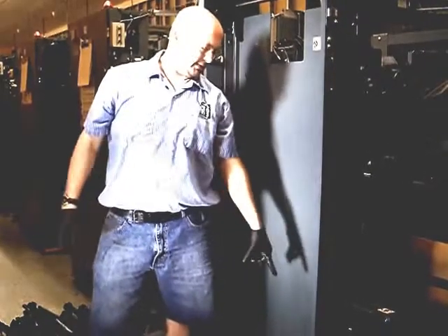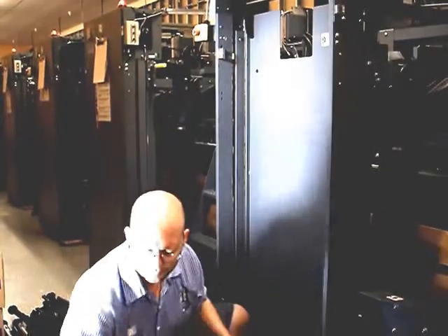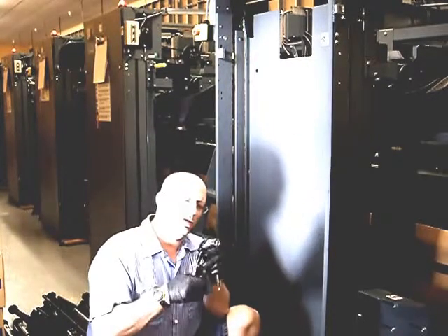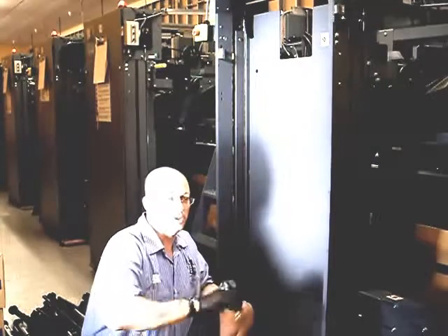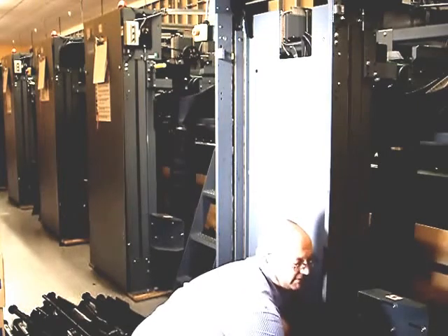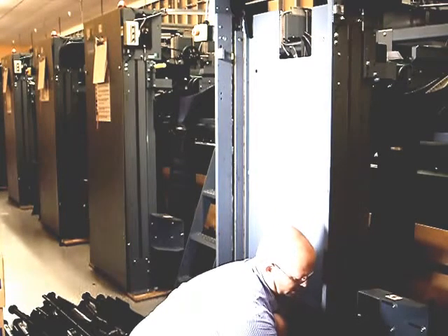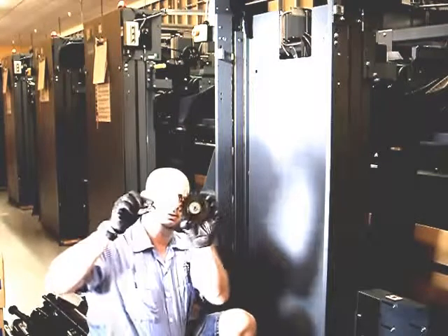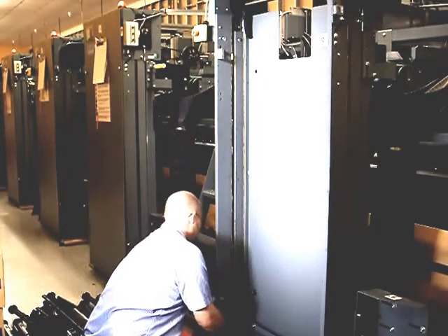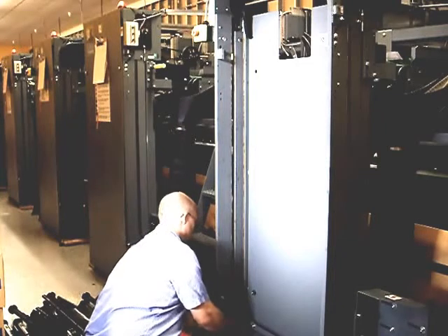The next step is to go ahead and take off the toothed gear wheels at the bottom and extract those — it makes it easier to clean the bottom of the elevator and to clean those gears. This is where you will need the 19mm socket, and you may need a pair of channel locks. There is a 19mm bolt down here on this wheel — just break it free. I am not going to need the channel locks. Back the bolt out, tooth gear out. Same thing on the other side — got lucky, didn't need the channel locks to extract it.